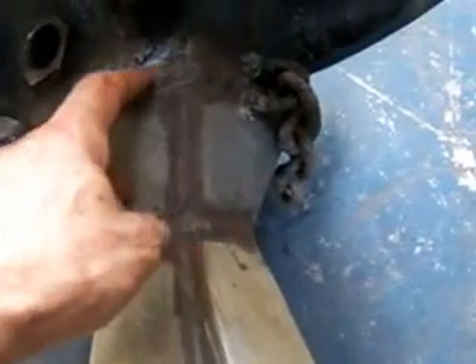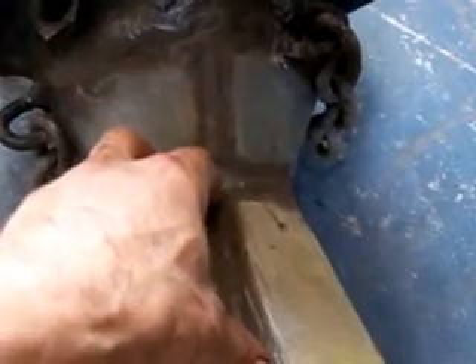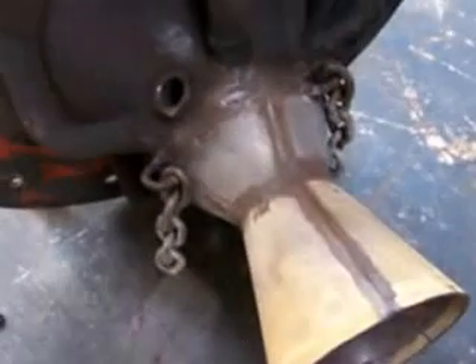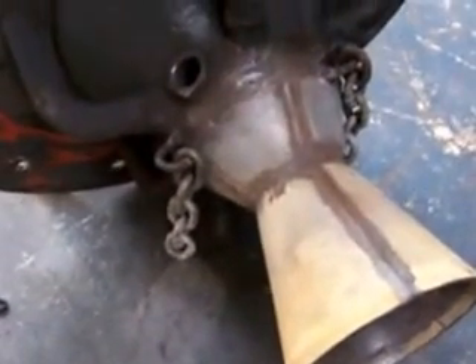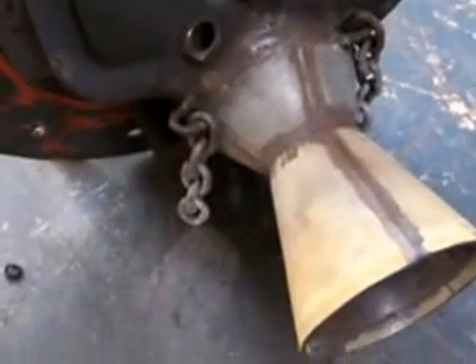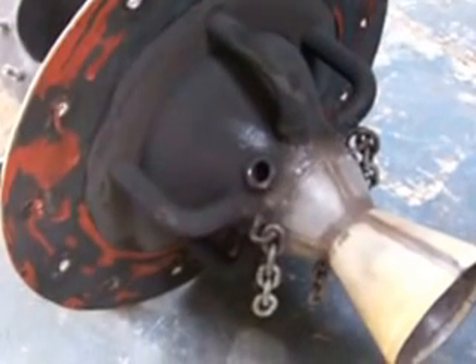I can get some feedback once I start hacking into this. Now I'm going to have to cut this weld line here right across, drop the cone out, cut the cone there again, add the straight section on the bottom of it, and weld it from the top back up there. I'm also going to move those chains and put them to the bottom of the flange where it's not so hot, because I don't think that's going to last a really long time. I want to know I can get a good two or three years running out of it before I have to seriously consider pulling it apart. I did build it very, very heavy duty to start with — unfortunately the design is not capable of producing what I'm after. So we're going to alter that and hopefully see some decent results.